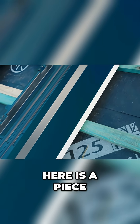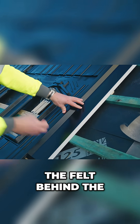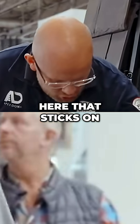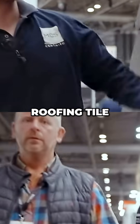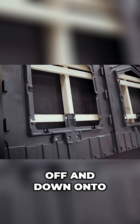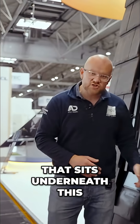You then install these lateral flashings. Behind these lateral flashings is a piece of foam that stops water from ingressing into the side onto the felt behind the actual roofing system. We have this flashing here that sticks on top of the actual roofing tile, so rainwater essentially flows from the top, runs behind the trays, off and down onto the tiles.